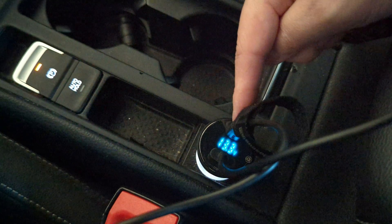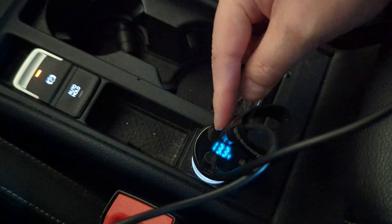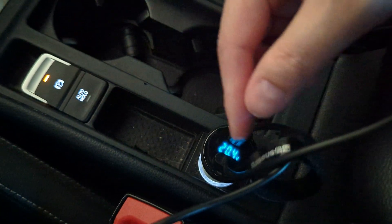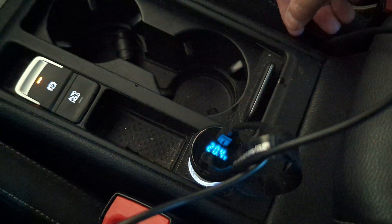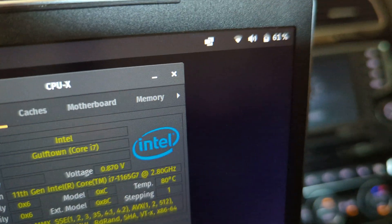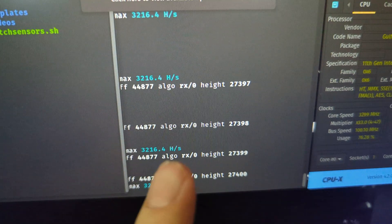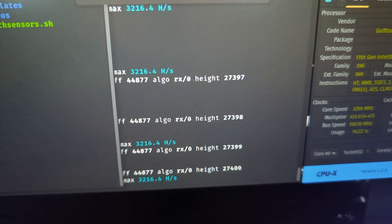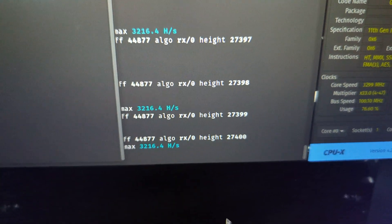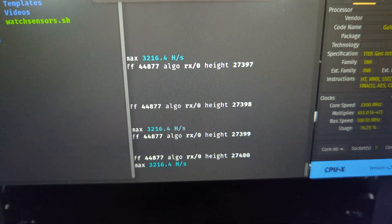The reason why USB-C is at 20 volts and showing 68 or 60-something wattage is because I have it hooked up to my laptop, and it's currently at 60% battery life, so it's charging the battery. I was making sure of that. And I have it at full power, high performance, so it's not limiting. If it's going to throttle, it's going to be thermal. But right now it's nice and cool.